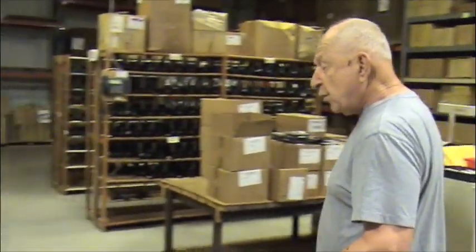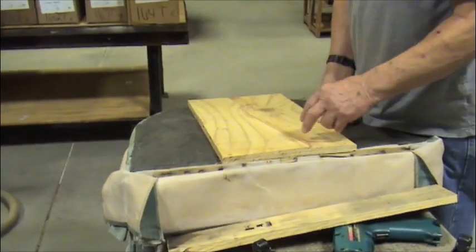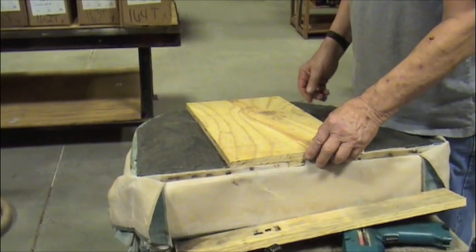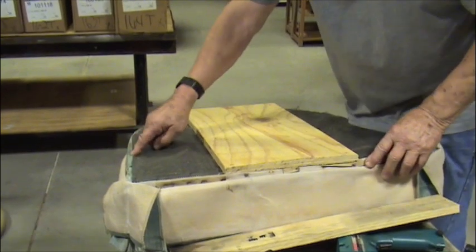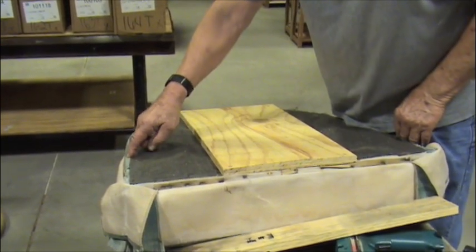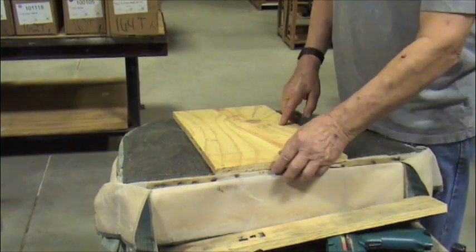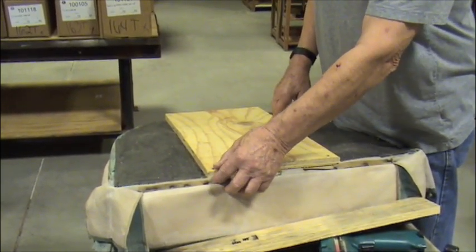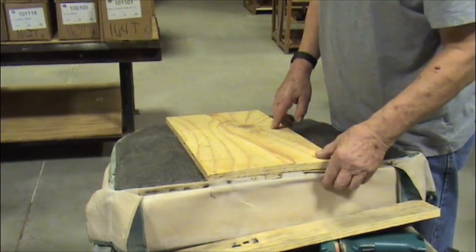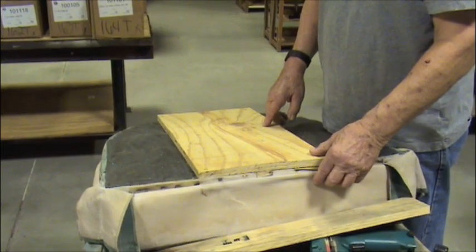One of the items that you will need will be a plywood board no less than 12 inches wide, that goes from the front of the chair to the back of the chair, or from one side to the other, whichever distance is shorter. The screws that you should use would be one and a half to one and three quarters inches long, and it would be a number eight or ten screw.